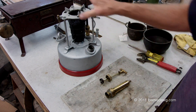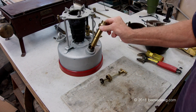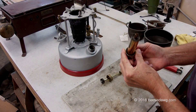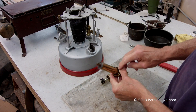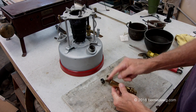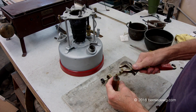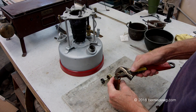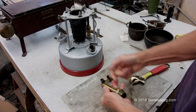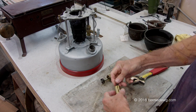Here is the furnace with the pump removed. This is the pump tube — it unscrews here. There should be a washer or an o-ring up in here, whichever you prefer. The important thing to realize is this part right here called an NRV, which is a non-return valve. You need to make sure it's going to work properly so that fuel doesn't come up inside the tube — it's basically a one-way valve.